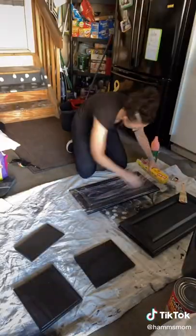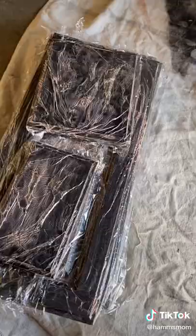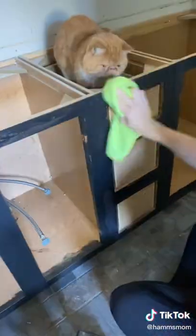There were a lot of layers of paint on the cupboard doors, so I added some paint stripper on them and then I added saran wrap on top of that and let them sit overnight. Then I started to prep the base of the cabinets — I sanded all of it down and cleaned it really thoroughly.